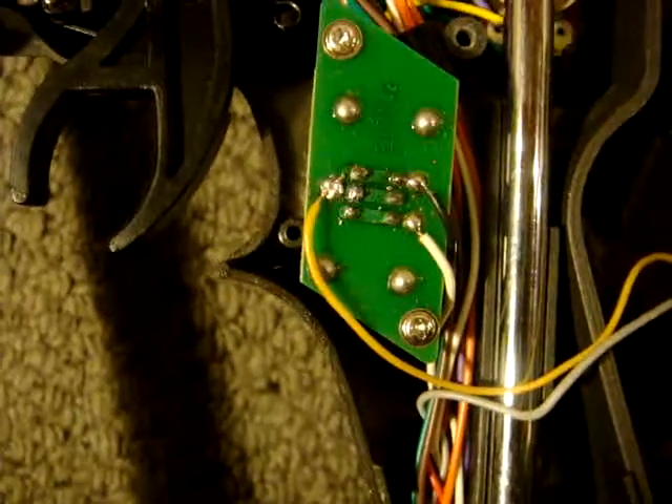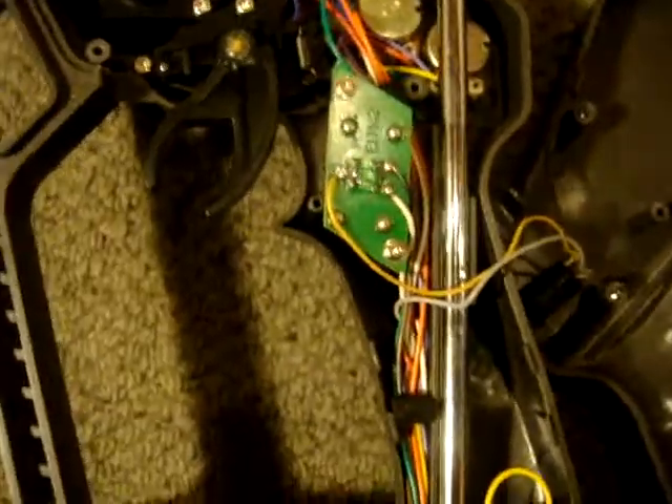That's basically the mod. When you close it all back up just take care not to close the wires in. So you desolder the grey wire. I've also done this on my 2.4 GHz transmitter — from memory the colour of the wire is different, I can't remember exactly what it is, but basically it'll be the middle wire, located either here or here. You desolder the appropriate wire, take another cable back to the same point where you desoldered it, and that creates the breaker and you're away.